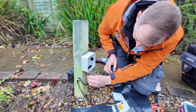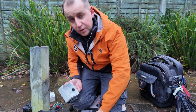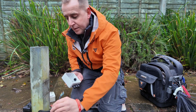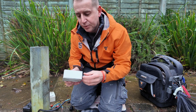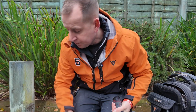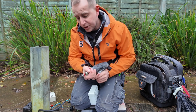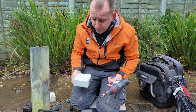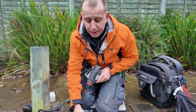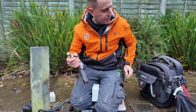That is never going in one of those properly. Rather than bodge it like the last guy — trying to stick this great big cable in a 16mm gland — I'm going to put a new 20mm gland in there. This is one of those things where you're a little bit under pressure and I could have just tried to jam it in like the other guy, but it's not worth it. It'll only make life difficult later, and that takes two seconds to do.